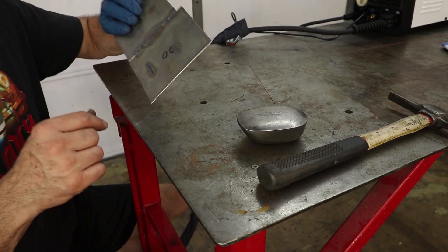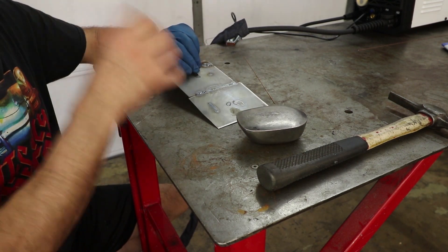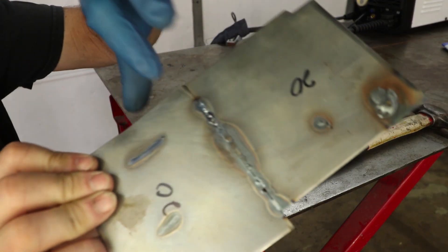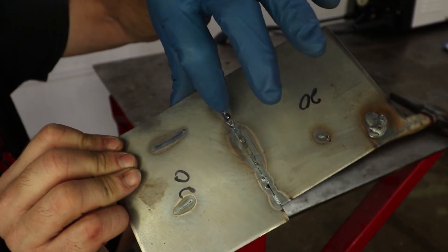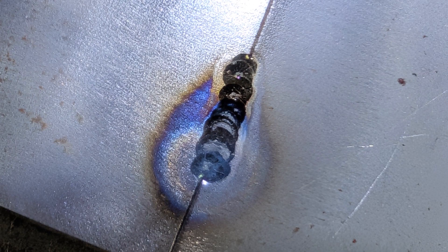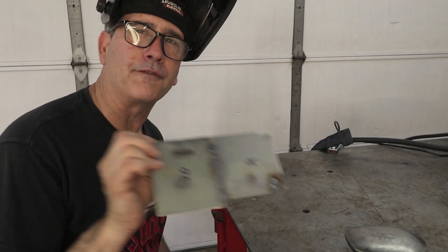The technique I'm trying is just stabbing it with like 80 amps, and that's able to get this weld started. I've been experimenting up and down. That right there is done with nothing less than 80 amps. Let me get some new metal and we'll start fresh.